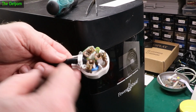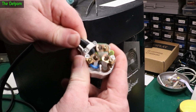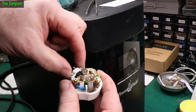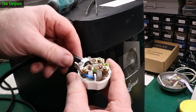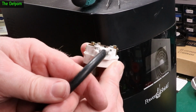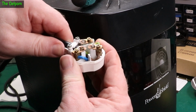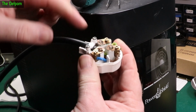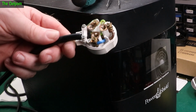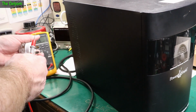Well, I've done those wires and put the cord grip around the way which I think is right, but it's not gripping very well. It's still sliding slightly. So maybe we'll try the other way and just see if I can get it to actually grip on, but the screws probably won't actually make it. But the fact that it was screwed right in before means this thing was actually never done correctly in the first place. I did manage to get it in there and you see it's bowing those out. I can't really do any more than that. I'm going to end up stripping it or something, or snapping these legs off. That now doesn't pull and doesn't turn, so I'm happy with that. But yeah, that is not what it was like when I got it, so it wasn't right from the beginning. Now seeing as that was like that, let's do a quick earth check of the actual casing and stuff,